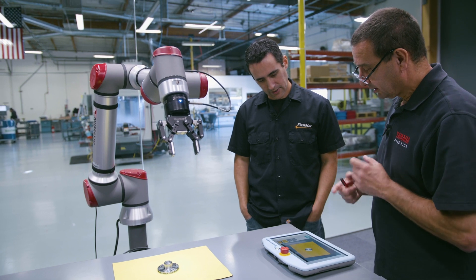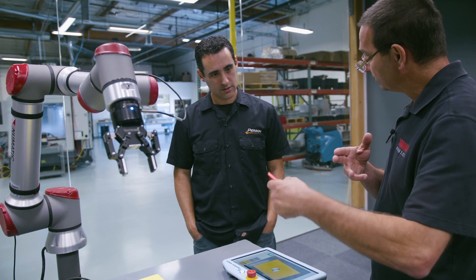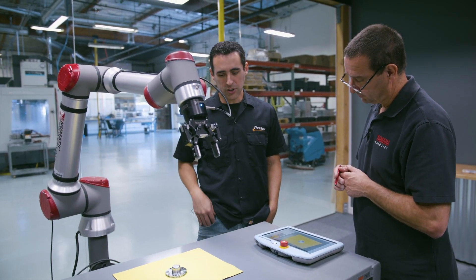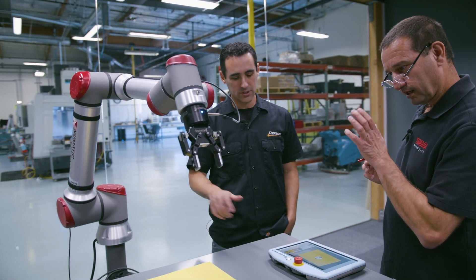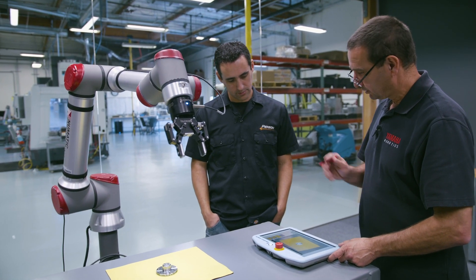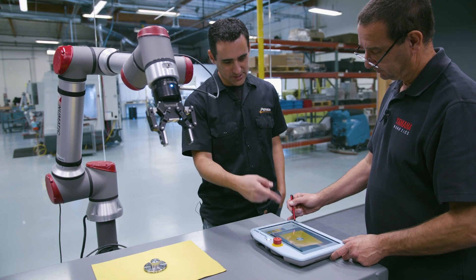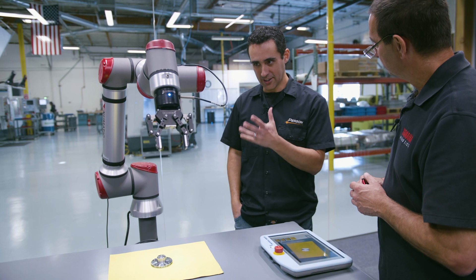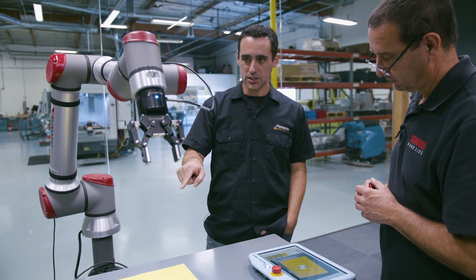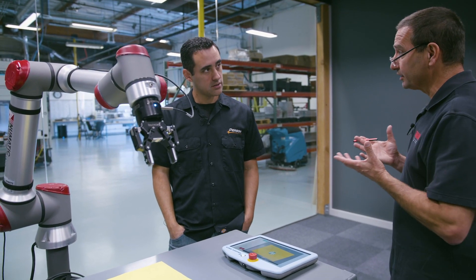You can get much more accurate. If this part was not circular — if it had, say, symmetry — you could actually rotate it 90 degrees four times and it would learn all variations. In this case we don't need to rotate it because it's circular, so I'm just going to go through the four poses. You would rotate it and say take another photo, so the camera can learn the part at different angles. Circular parts are a little easier because there's no distinction from any angle — it's still processing. How do you know where to place the robot to do this process? It just depends on how many parts you want to pick up and what your physical real estate looks like.